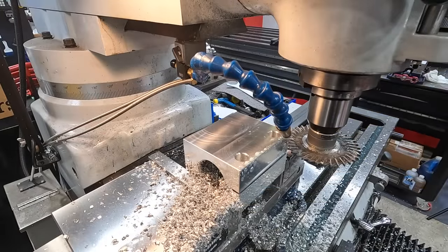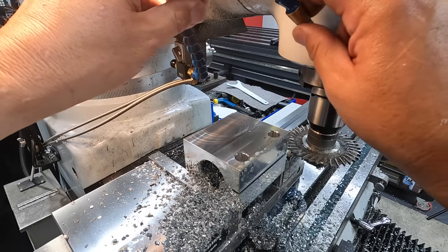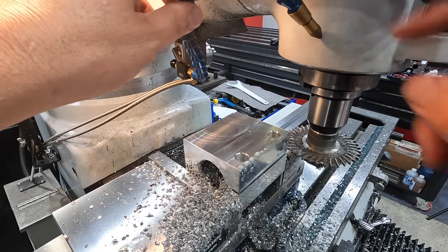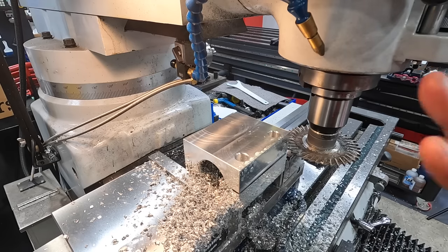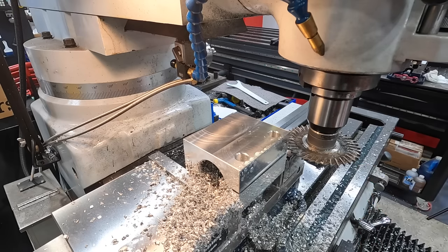Well, that worked out pretty good. Didn't have any problems. You're always going to get just a little bit of chattery vibrations when you're doing these slitting saw setups like this, especially on these particular type of milling machines. It's hard to get away from it. If you're using something like the Kearney and Trecker, a big solid milling machine, you can do operations like this and all you hear is just the chip being cut. But anyway, I'm real happy with it.